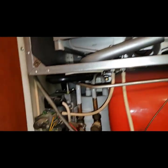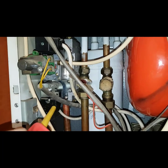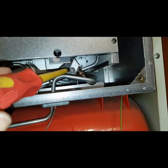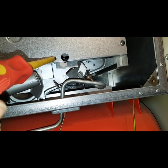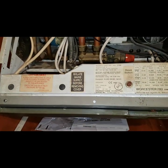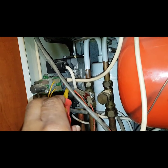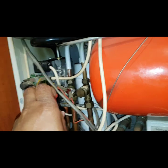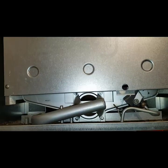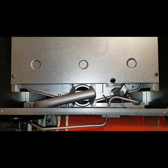Once the fan turns, the gas valve will open. You've got this tube here which goes to the pilot via that solenoid I mentioned before. That solenoid activates, lets the gas out through the pipe to the pilot burner, which then lights. Once the pilot is established, you get flame rectification that goes down that lead back into the board. The board detects that, then it will energize the main gas valve solenoid, which lets gas through into the main burner.